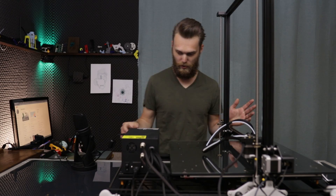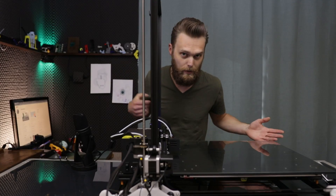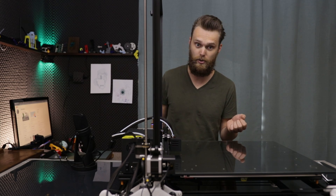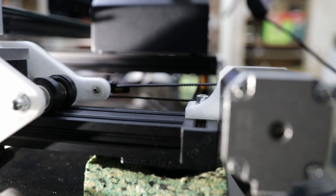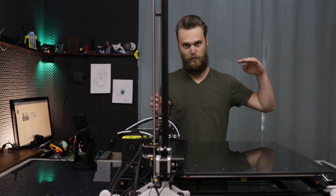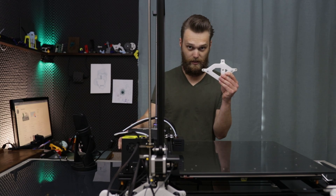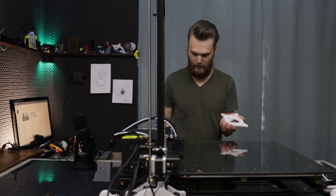I've made a design flaw. If I move the printer all the way to the back or to the front, it collides with the motor mount. At the front, it collides with the belt tensioners. Another problem noticed by a viewer — quite a sharpshooter observation — is that the belt at the top isn't perfectly horizontal; it's not in line with where the belt is mounted on the brackets. So the gantry moves faster at the beginning and end than in the middle. I've made a redesign: these parts are a bit higher so it's in line with the pulley, and this part goes over the motor mount — fixing both problems. Let me put these on and then continue torturing this machine.